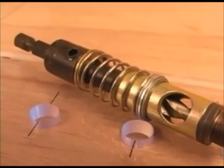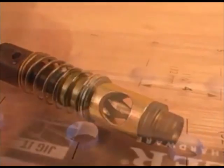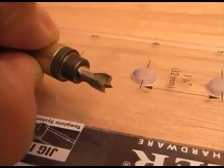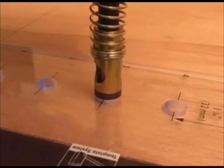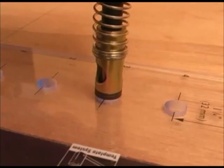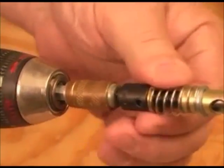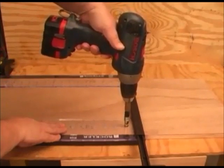This is the quarter-inch centering bit that I use with this jig. They also offer the same thing in a 5mm. Inside this spring-loaded housing is a real brad point bit that drills very clean holes. The step bushing at the end of the housing fits the holes in the jig very closely. The quick-connect shank is designed to fit all the common quick-connect chucks. And now you are ready to start drilling out the shelf pin holes.